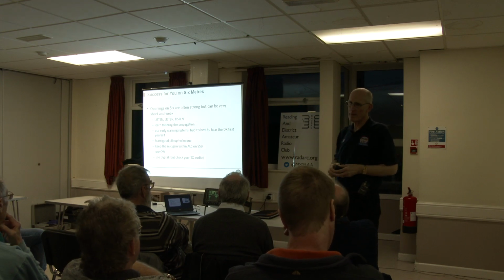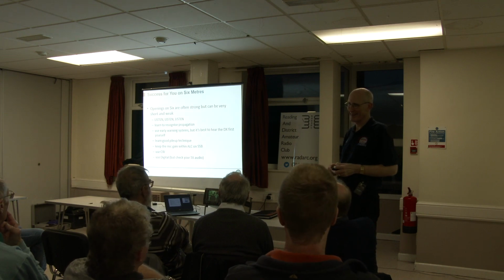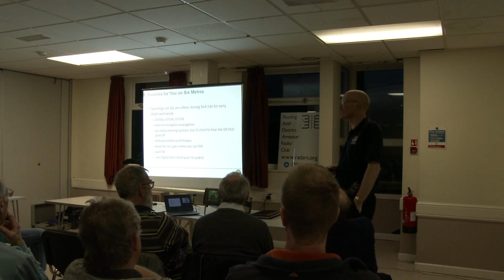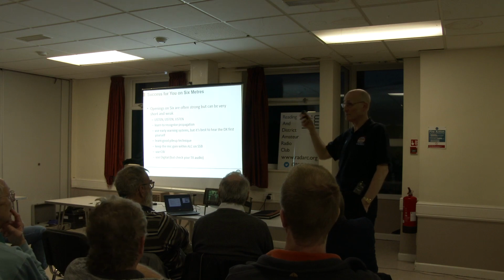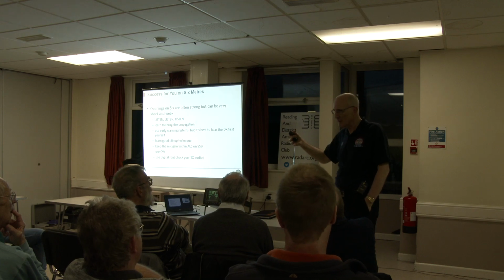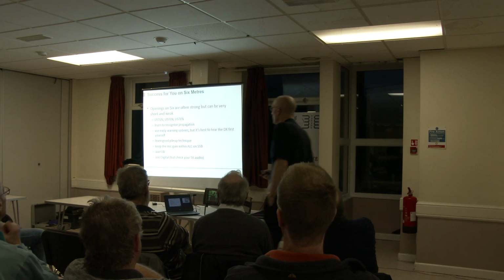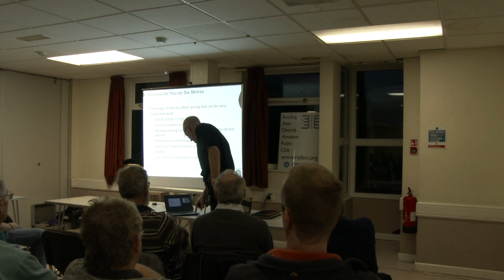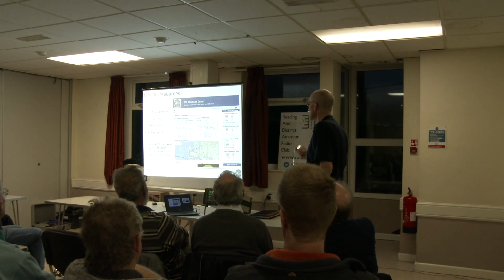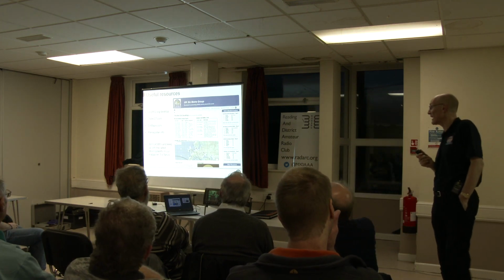The one thing I keep telling people is there's a setting in WSJT which I think should be mandatory, that's the split. Otherwise you're transmitting your second and third audio harmonics all over the place and it's horrible. Even with a decent tone, it might be 30 dBs, 40 dBs down, but people can still hear it. So do check your audio if you're having a go at digital.